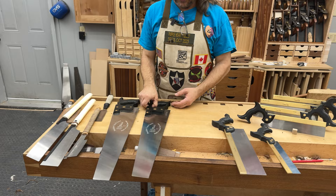If you look at the teeth on a rip tooth, they have two surfaces creating the cutting edge — this face and the back — and it goes through the wood like a chisel. A crosscut tooth has one face this way, one face that way, creating a point. The points alternate — one on the left, one on the right — and that's designed to go in like a knife and score across the grain to prevent bad tear-out. You can rip with a crosscut and crosscut with a rip, but it's not going to be nearly as efficient. If you want a really nice crosscut, get a designated crosscut saw.